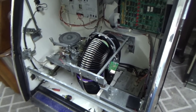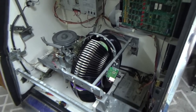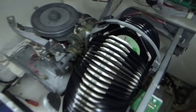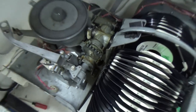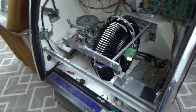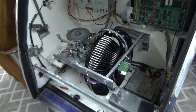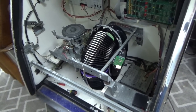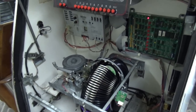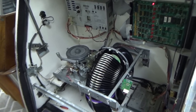This is the 496, so it's a little different than the 490 and all of that, but I hope that helps you. Ours is a little farther along. I'll do another video where we work on the amplifier, because obviously we've got some major issues with it. Looks like we've got it kind of mechanically doing its thing. I still need to disassemble the gripper arm, oil it and all that, because I see it stuttering a little bit. We've got it doing its thing where we can make selections that will play the record and then hang it up. Mechanically it's at least functioning — it just needs to function a little better. Sonically, it's not working very well at all yet.